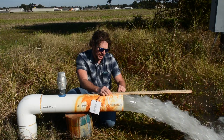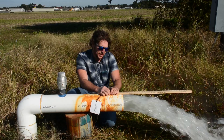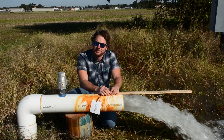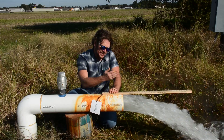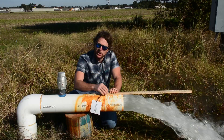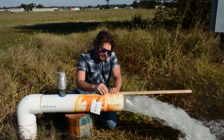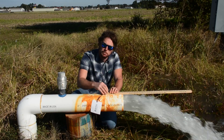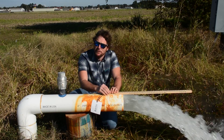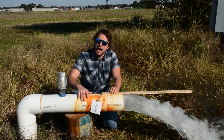The very top of the water is hitting the discharge point, so at 28 inches along this flow stick is where our measurement is going to be. To get your flow rate, you take 6 inches — the diameter of the discharge — times itself again: 6 inches times 6 inches, times 28 inches, which is the length I needed to push out. That's roughly about 1,000 gallons per minute on the 6-inch discharge.